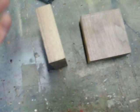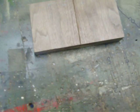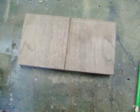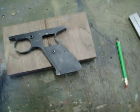Then it's just hand sanding and sanding with power tools to remove all the rest of the material — a lot of stock removal. You end up with my typical target grip profile that I then sand down to 320. I apply my finish, steel wool, apply my finish again, and then ship them out. And that's what you do when you want to make some really nice grips.